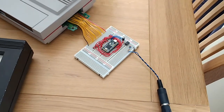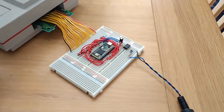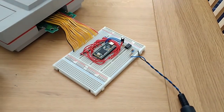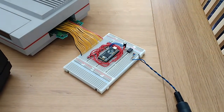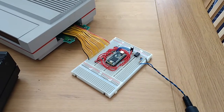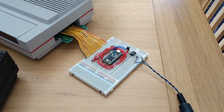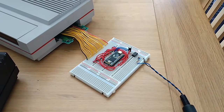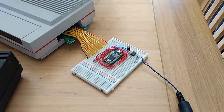IMD also listens to the MIDI interface through this little lot here. I got this circuit direct from the Teensy website. The Teensy filters and translates the incoming messages before making them available to the master component at an address in its memory. From there, they're read by a patch to Josie's simple synthesizer and used to play notes just like the ECS keyboard.